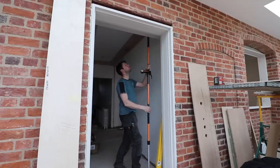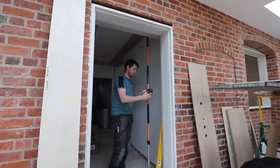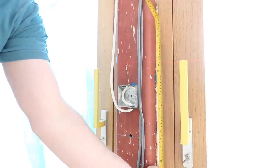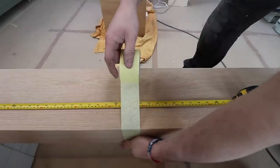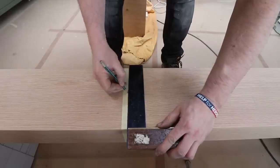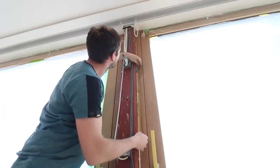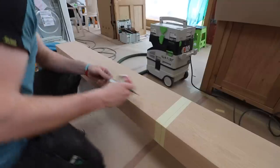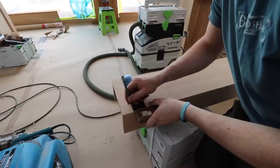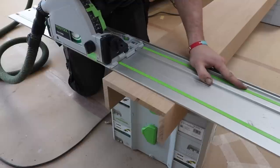Back on site with the beams. I'm setting up a laser level across the room and casting a horizontal line across the location where I'm installing the box. I then measure up and down from the horizontal line to mark the cuts on the beam. The floor was level so I just marked a line up from the bottom of the beam to the height from the floor to the line, and used the laser line to measure up to the ceiling points on all four corners. This is a very simple way of getting an accurate cut all the way around the box work, and should mean the beam fits in place on the first attempt if you cut accurately to the lines.